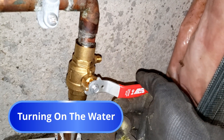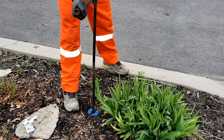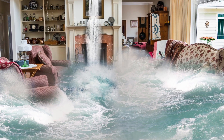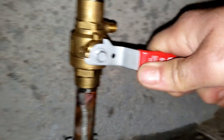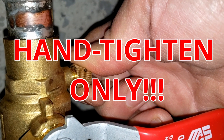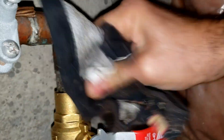Ensure that the valve is in the OFF position, or perpendicular to the pipe, and notify the public works technician — who's hopefully still waiting outside — that they can proceed to carefully but slowly turn the water back on. This is the part where you anxiously run inside as quickly as you can to ensure that the basement is not flooding as a result of a poor joint connection. Presuming there was no flood, you'll slightly crack open the valve, upon which you should hear water flowing through it and see some water escape through the drain port. This will also quickly cool the valve, allowing you to replace the drain port cap without damaging the internal rubber. Then turn the valve back off, install the drain port cap — which you will only hand tighten snugly. Do not use pliers for the cap. Double check your joints and adjacent connections for anything fishy before fully turning on your shiny new main stop valve.